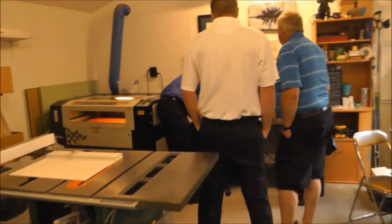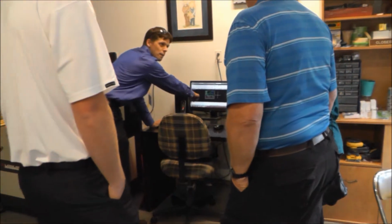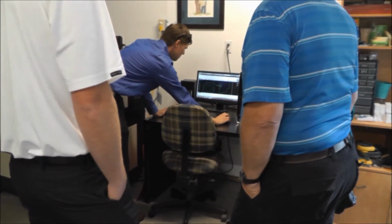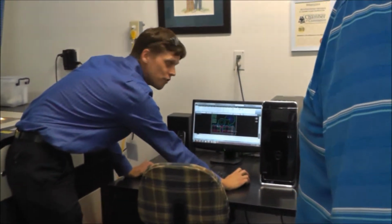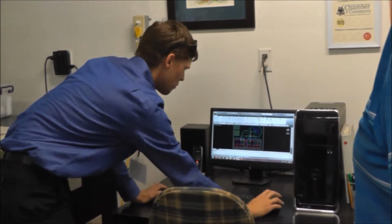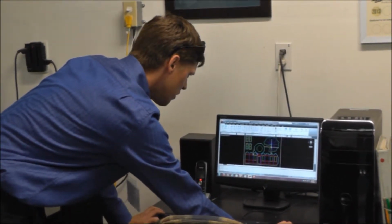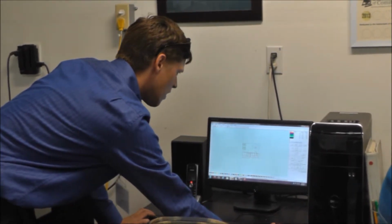Sort of CAD program, like AutoCAD or something similar, you'll draw up the object that you want to make. You can use different colored lines to get the laser to do different things. So I have these set all for different reasons. The different colors will be assigned a different value. When you're done setting that all up, you bring it into your laser cutting software.